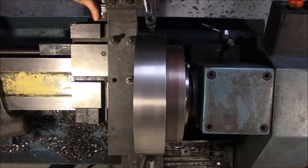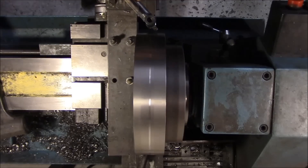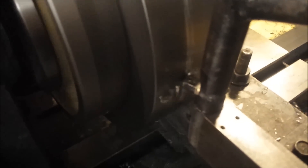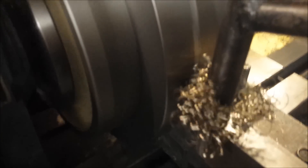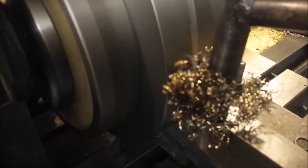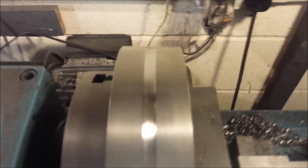Touching off — that's at zero, so we're going in by one mil. There you go, there's your first cut one millimetre deep, so this groove will be half a millimetre deep. Now we go in by one more, and you keep going.